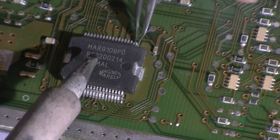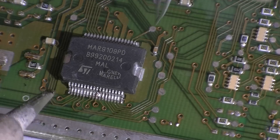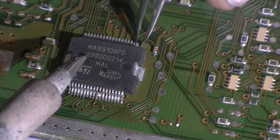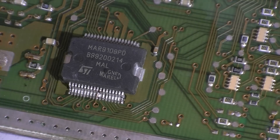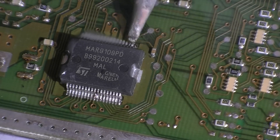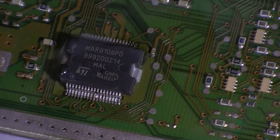Okay, so that's really nicely centred. Just put a little bit more flux there — you can never add too much. Solder that down. Okay, that looks pretty good — not bridging anything else.